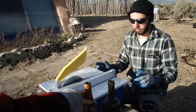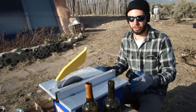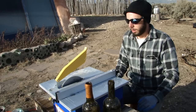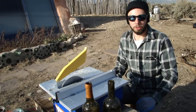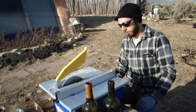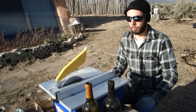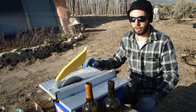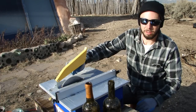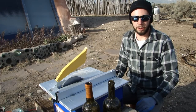So this here is an inexpensive ceramic tile saw — it's a wet saw. I got this one for under a hundred dollars at the local hardware store. You don't really need a more expensive one; this one works just fine. It's got a bath of water underneath. This particular one throws a decent amount of water up as it's running, so we have to replenish as we're going. The diamond tip blade sits in the bath and when it runs, it runs through the water and cools off the blade.